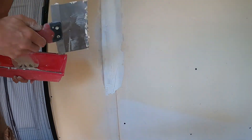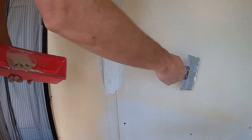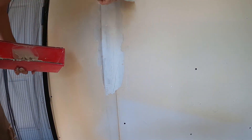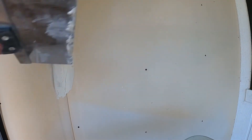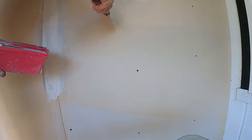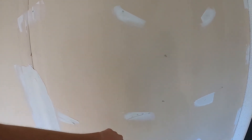Before you sand, also make sure all of your screw holes are covered up. Go through the wall and cover all the screws. A side note: you definitely want to check your local code, but a good rule of thumb for screw spacing is 12 inches on center down the studs, and on the edge of the panel, about 6 to 8 inches on center. But again, check local code to make sure you're up to spec.